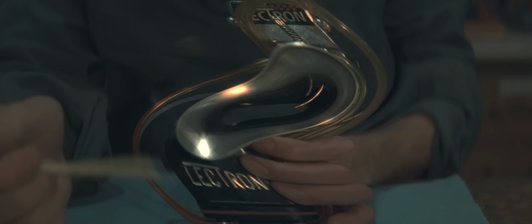I've had this apart several times now. I'm kind of ashamed I haven't noticed and done something about this earlier. We will do now though. Now the floor is completely smooth here, and no step before that hole where fuel is drawn in. Let's see how it behaves. Okay, first test with a main circuit in the carb that actually works. Let's see how it behaves.